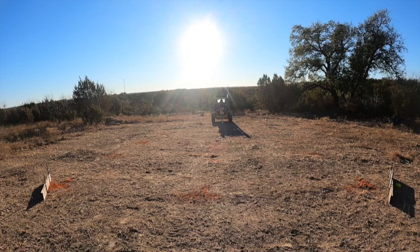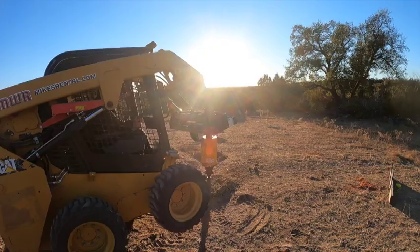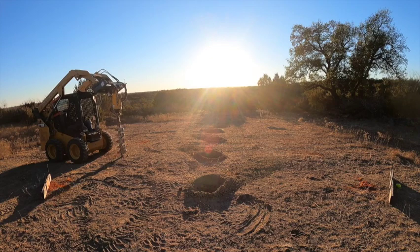When you're digging these pier holes, I'm using — I believe it was a 12-inch auger — but I was moving it around a little bit because I needed to make it larger; I think I made it around 14 inches. I was going down until I hit bedrock. You can see the front tires of that skid steer kind of coming up off the ground — that's because I really want to pressure and go as deep as I possibly can. I found that the top holes here closest to the camera ended up going down maybe four or five feet.